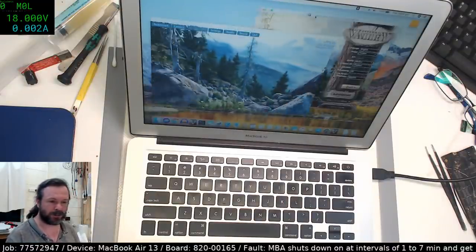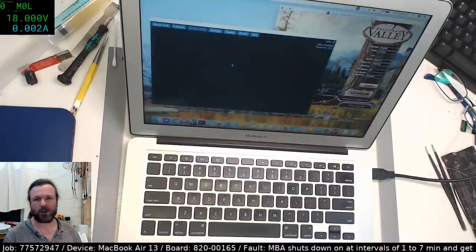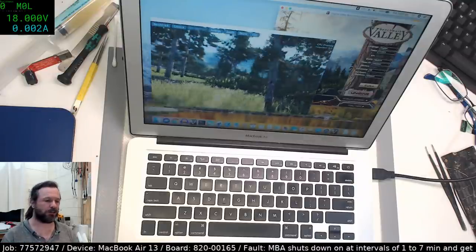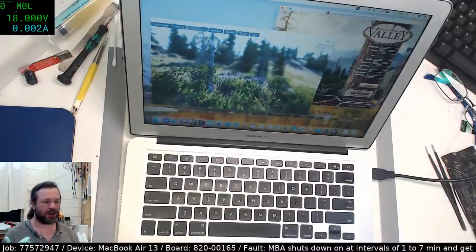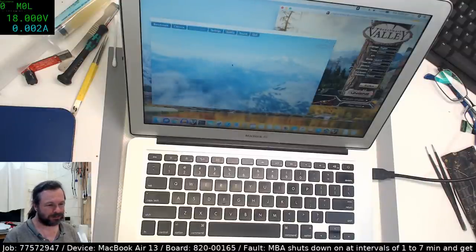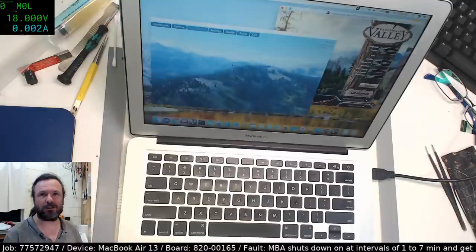If your iPhone is catching on fire, replace the TriStar. Yeah. And I mean, you can run a business like that at times. You can basically have a checklist of items to replace blindly. So you replace the TriStar, you replace 3V3, just things like that. And so you don't actually have to have techs with any sort of diagnostic capabilities, and you kind of hope that just over time they'll develop one anyway. But this is me, and I prefer not to do that. At least by going through this route, I learn perhaps a bit more about what's happening underneath.